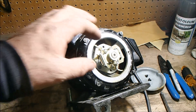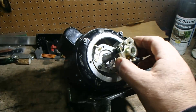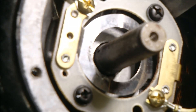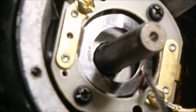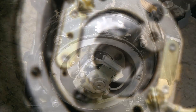I'm taking the motor apart and I found the culprit. This is a centrifugal switch — when the motor comes up to speed, centrifugal force throws this out, which disconnects the start capacitor as soon as the motor gets up to speed. The problem is inside there's a contact — this flexible ring, like old points on a distributor — and those contact points had fused together. So the start winding wasn't working properly. I took it apart and sanded both sides of the contact, reshaped the ring, and it seems to be starting just fine now.